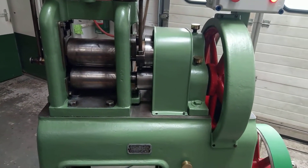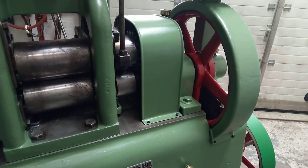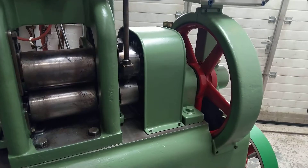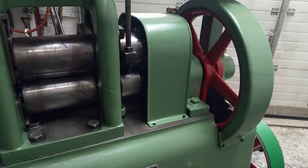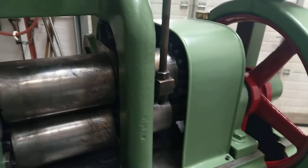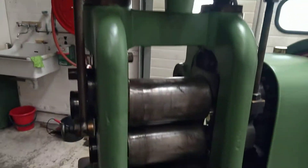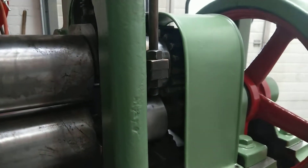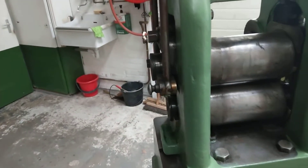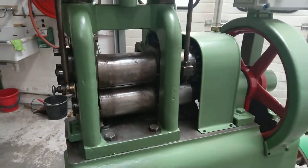What's typical about this machine is it does not have the long drive bars. It works by sprockets, and the teeth of the sprockets go up and down when you crank this wheel — which is for altering the height of the rolls — and the teeth also go higher or lower accordingly. You can tilt the roll a little bit with this knob, so it can make banana-shaped forging.